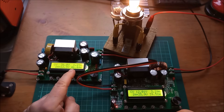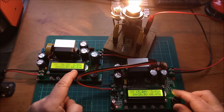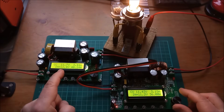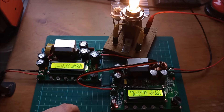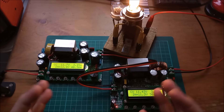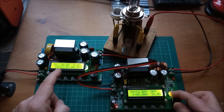Turning on the lamp at 12 volts with a 2-amp current limit on the boost converter, I start turning up the voltage on the buck converter — 14, 15 volts — and as we approach 2 amps on the boost converter it goes into current limit. But then there's a collapse of voltage, dropping to about 11.7 volts, which is basically 12.4 minus a diode drop. The buck converter is only getting 11 volts input so it can only put 11 volts out, and the brightness of the bulb suddenly falls. Turning this off, the boost converter springs back up to 36-volt output.